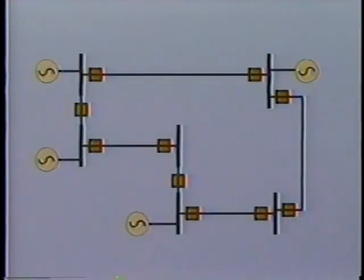Transmission lines normally form part of a complex network which interconnects many lines and buses and also includes several sources of power generation at different locations. As with the loop system, the current in any particular line can, in most cases, flow in either direction, according to the configuration and loading of the system. All of this adds to the complication of providing adequate protection, as we shall see.